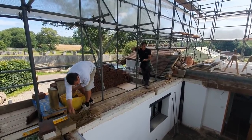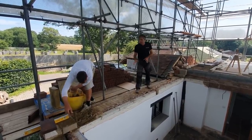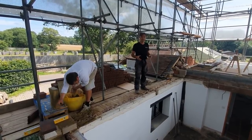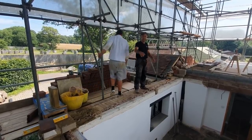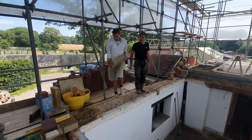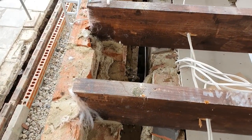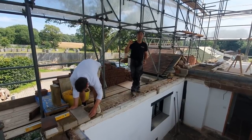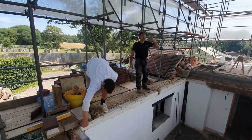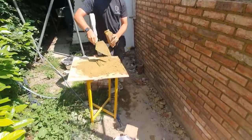Part of the brickwork on this job is rectifying existing walls. On the really old section of building, they'd put a concrete slab inside and gone round with an insulated blockwork skin that shared some roof loads — then closed the cavity with anything: bits of tile, bricks passed across, all loose and wobbly, built around the joists. As we took the joists off it all went everywhere. He's going back through now with a dense concrete block to close off the cavity properly.